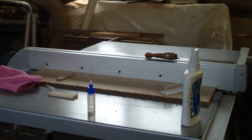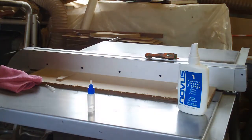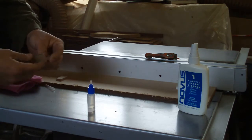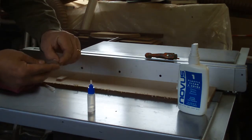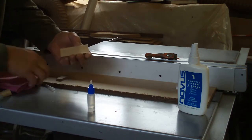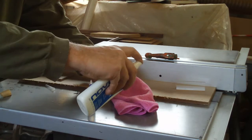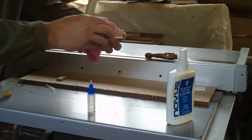I'm going to show you a little bit about gluing parts up. This part is going to be glued only on this side, so I only have to peel the paper where there's going to be glue in the area. Make sure everything's nice and smooth. You spritz the rag, wipe the area down, and then dry it.